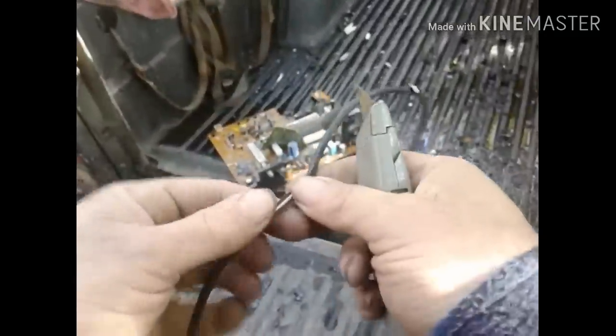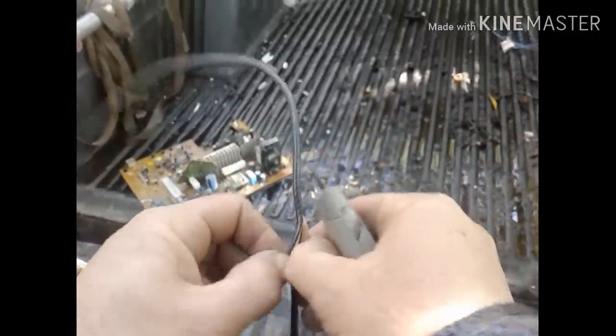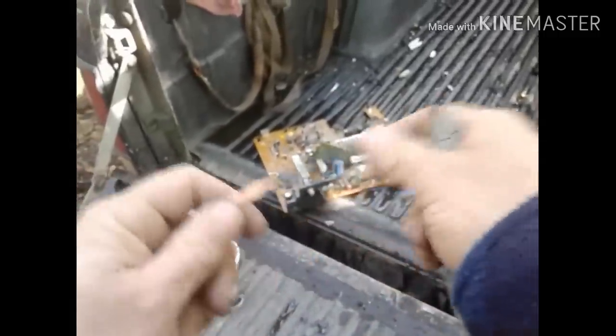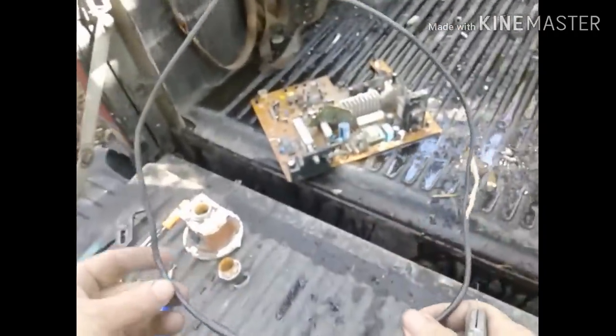I'm going to peel this back a little bit. Most of these wires that go around the tube are just insulated with tape, basically electrical tape. The first thing I do is peel back some of the wire, take my blade and scratch across it, have a look at it — make sure it is copper. And this is indeed copper wire, so I'll strip that and have a little piece of clean number two.